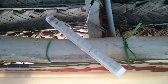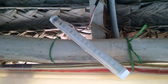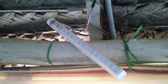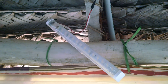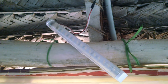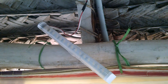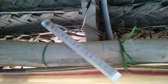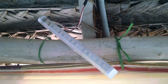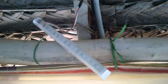I'll post the links in the comments. Your charge controllers will automatically cut the power supply to the load when you are at 11.45 volts. This pretty much treats that as 50% of the battery's charge, to make sure your batteries stay in good condition and don't use up too many charge cycles.